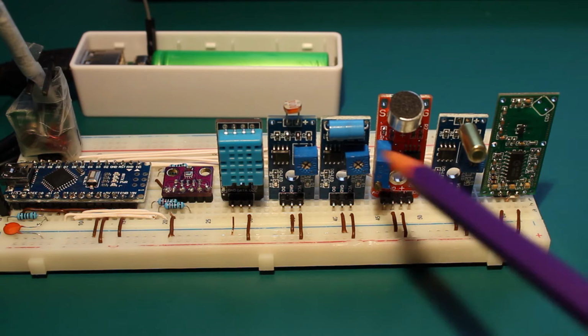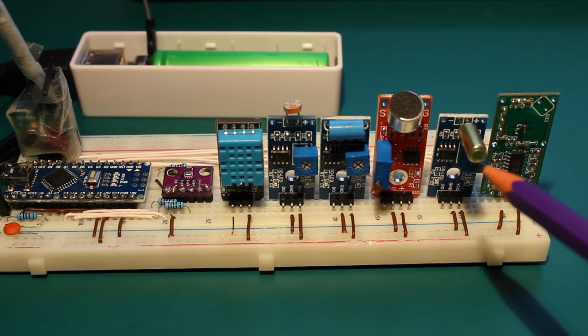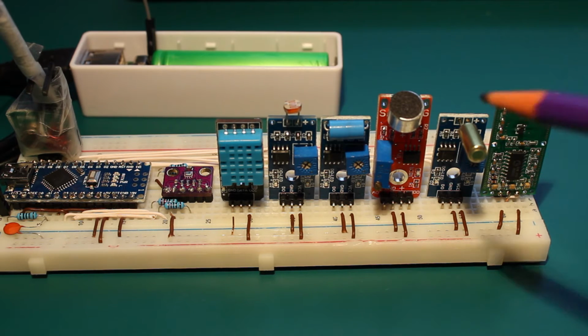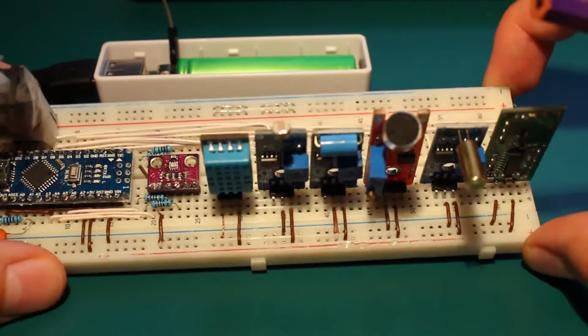Second, we have a tilt sensor. This is the eco version of the mercury sensor, in which when you tilt, the liquid metal goes away from a switch and it closes or opens the circuit. This works with two little balls. So I will just swing it.